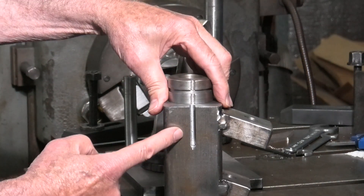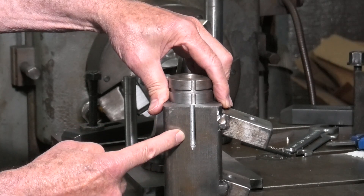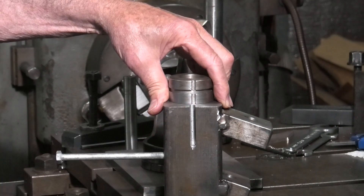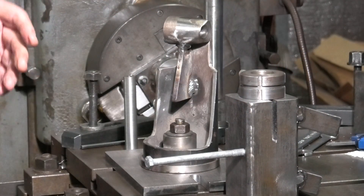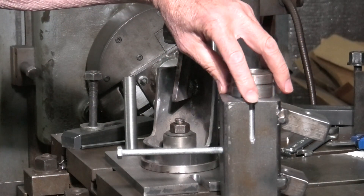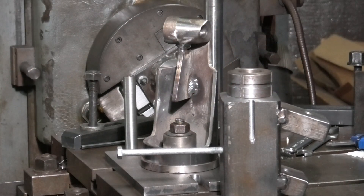Up on this surface I'll just be bolting a bit of angle to the top face and bolt through that for pivoting of the latch. I think that part will be easy. The manufacturing has been reasonable — even that slot, about 12 or 13 millimeters deep with a 6mm slot drill, went quite easily.